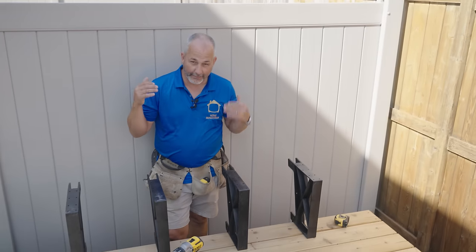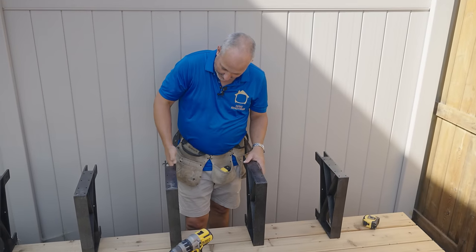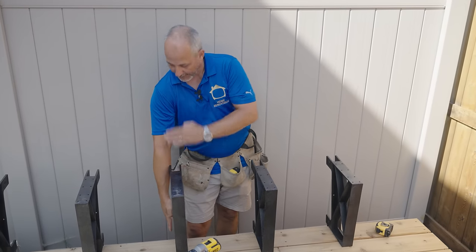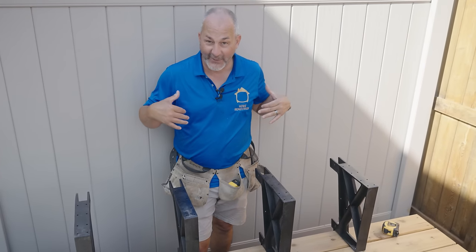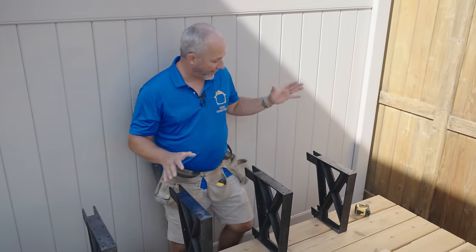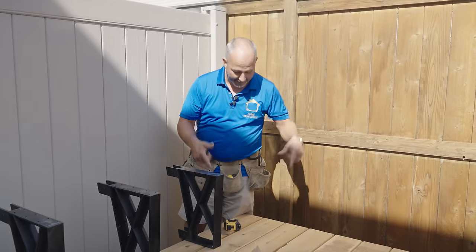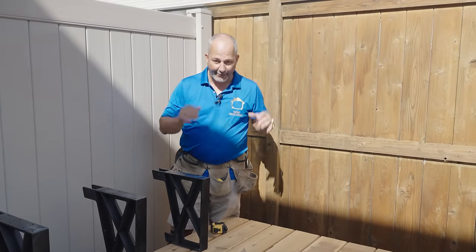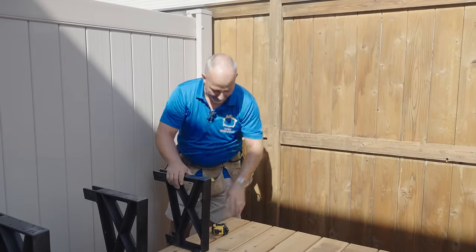I'm just gonna try to really pay attention to my order of doing things. I get a 2x4 that comes in the back of this slot and it follows my arm on an angle, for a backrest. And as soon as they're installed, I can't be here. So I gotta kinda install those on my way out, which means it's probably best for me to build this inside table, get this in place, screw it in place, and then I can continue working on the rest of these benches from the surface of the deck.